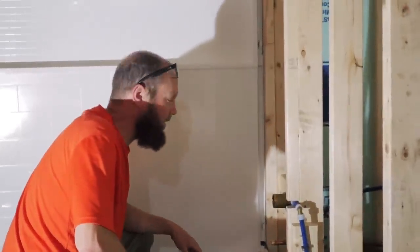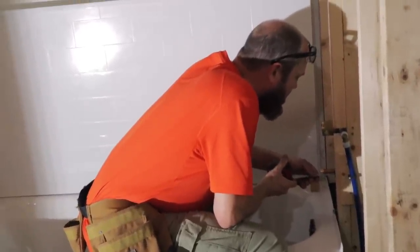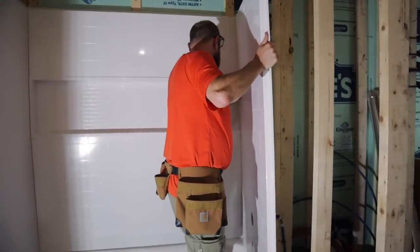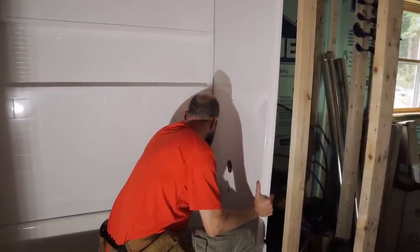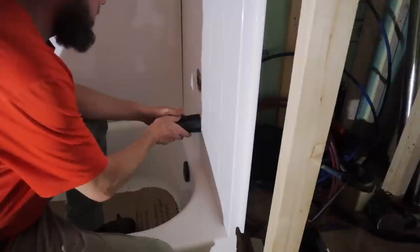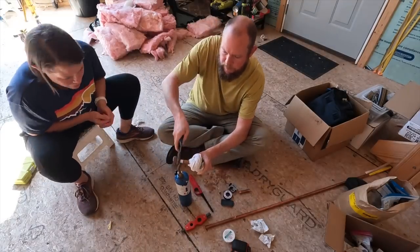Is it time to dry fit? I think so. It's like an inch and seven-eighths off the wall — well, for dry fitting purposes it'll work. Last you saw us, Ryan had just soldered together the pieces we needed for our tub faucet. Before we actually soldered those completely in place, we decided it would be a good idea to put in that last panel of our tub surround to see if we could even get it past with that in place. Well, we couldn't. So now Ryan has to unsolder that piece and we have the correct connections so we can do it all after we put in that tub surround wall.